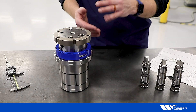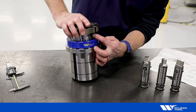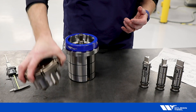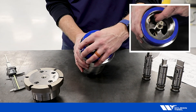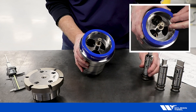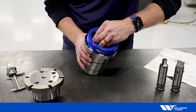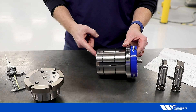I'm ready to put the punches into the tool. I need to remove the head — there's a button on the side of the head that I push to release it so it comes up off of there. Then I drop my punches in. I need to turn the skid plate around over the station I'm adding the punch to, so for my triangle I line that up and drop the punch in.